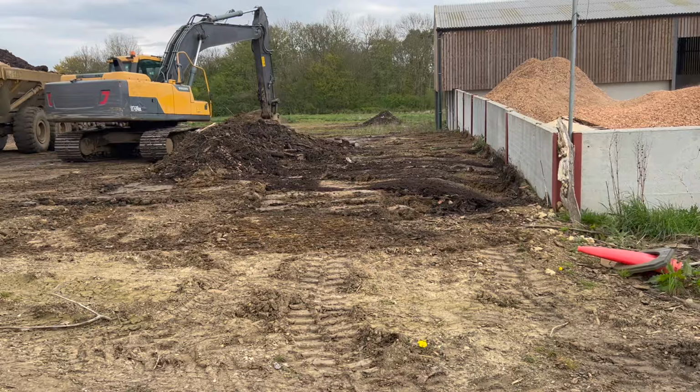Last week we were using the trommel, but I'll go and show you what the problem is there and how we're going to have to redesign that. Okay, this is the trommel that we had built. You might have seen it in the previous videos. But what is happening is the weight is too great, and I'll just show you, all the arms are breaking. So this one's broken. That one up there is broken. If we go down the other end, those are broken down that end. Actually, the only one that is holding is the middle one.